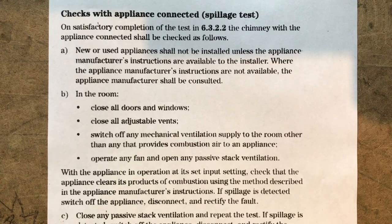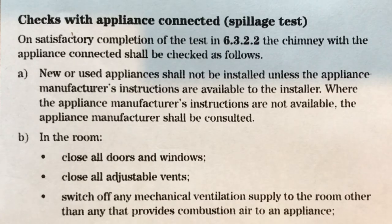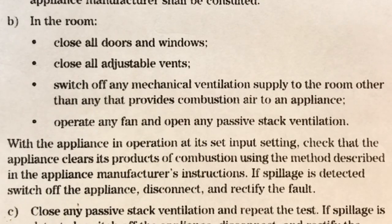So this is what BS5440 part 1 says about checks on the appliance for a spillage test. On satisfactory completion of the test in 6.3.2.2, the chimney with the appliance connected shall be checked as follows. New or used appliances shall not be installed unless the appliance manufacturer's instructions are available to the installer. Remember that. Where the appliance manufacturer's instructions are not available, the appliance manufacturer shall be consulted. So, if it's in a room, close all the windows and doors, close any adjustable vents, switch off any mechanical ventilation supply in the room other than that which provides combustion air for the appliance, operate any fans